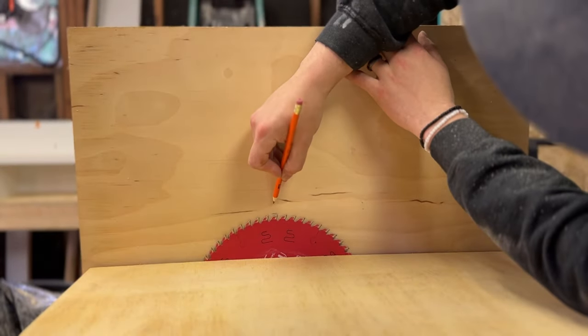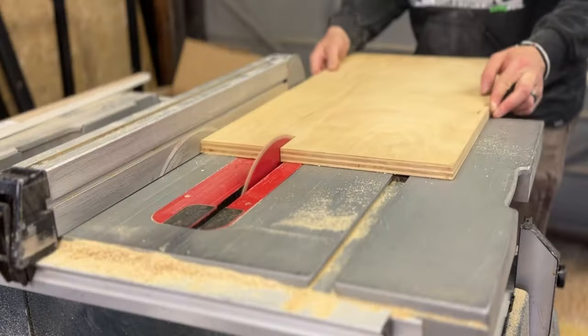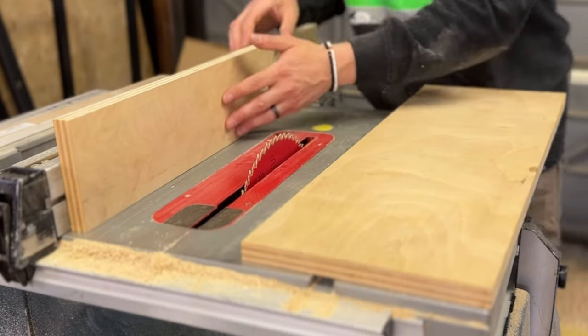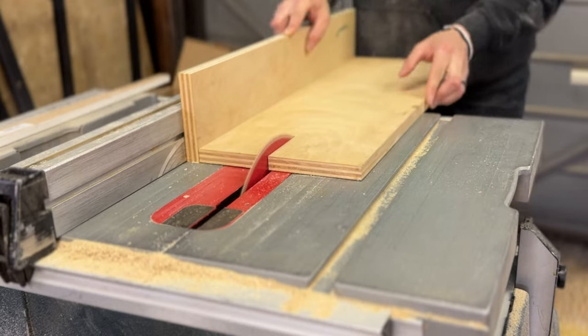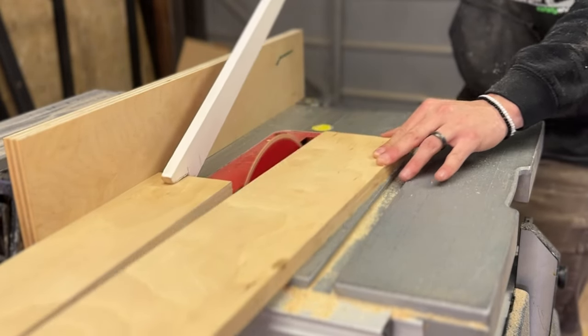The first thing I'll do is figure out the height of my back fence on the sled. I want it about an inch taller than the max blade depth on my table saw. Then I rip a strip of plywood to this dimension, then take that piece and use it as a spacer for when I pass the next strip. It will give me a piece that's exactly the thickness of the plywood narrower in its width.